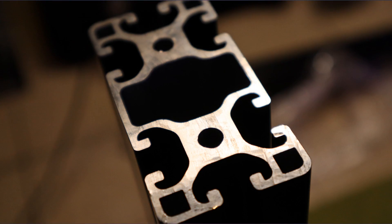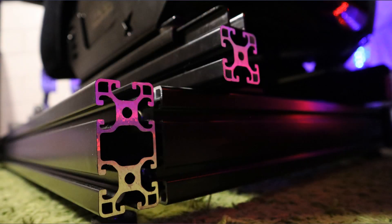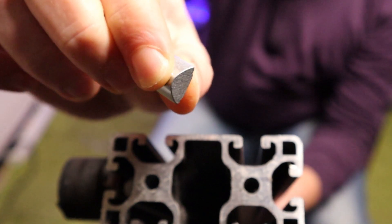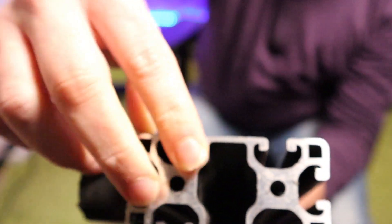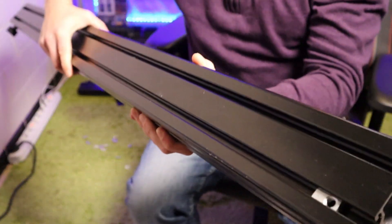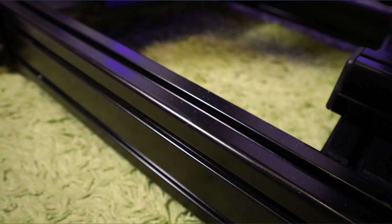Apart from this I have very little to complain about. The 80mm profiles look and feel very sturdy, with a clean finish and no sharp edges. The same goes for the 40mm profiles that are included — they make for a very stable unit. The T-nut principle with the little locking ball works fantastically well; it keeps the nut in place when you attach the bolt — very handy. The matte black paint is also of high quality. There are some markings where configuration is done but overall it seems fairly scratch resistant.